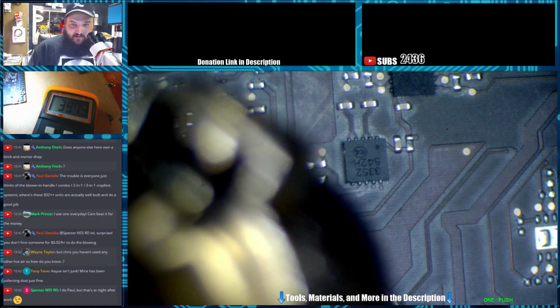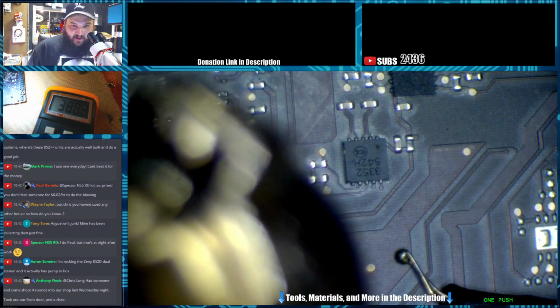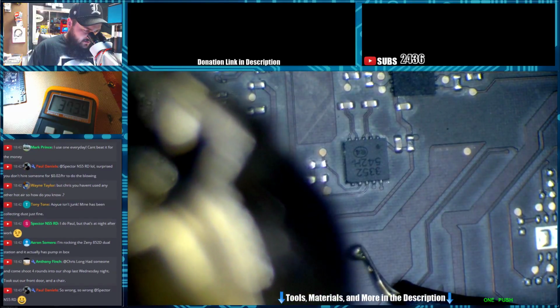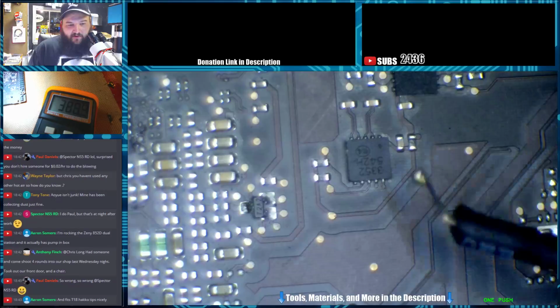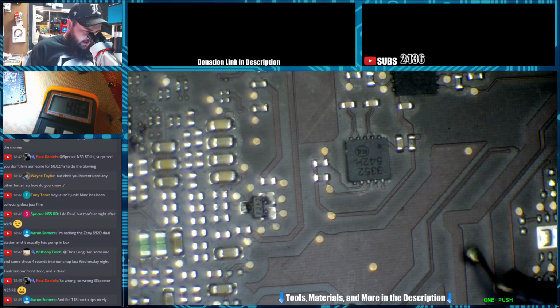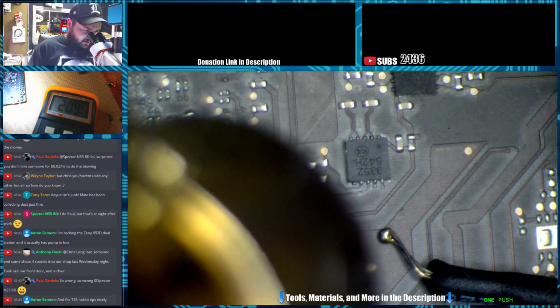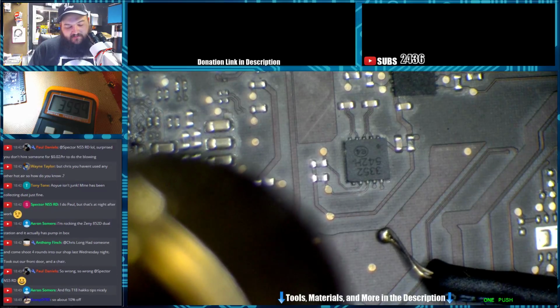So you can see the temperature that I'm actually getting on the board is higher than what it actually reads on the output. It's about 30 degrees higher, which would explain why I work at a lower temp. So 25-30 degrees. I would suspect that you'll see similar, and this temperature changes based on your airspeed. There's a bunch of stuff that changes it.